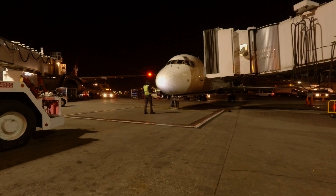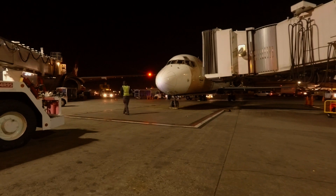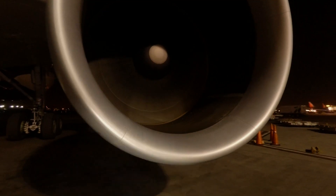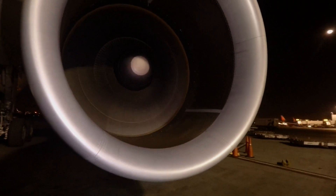And then when I have to look all the way up at the top of the vertical stabilizer, I'll turn it into the spot mode. Even with our logo lights on, it'll overpower the logo lights and allow me to see if there's any kind of bird strike, a dent in the leading edge, or any kind of delamination — anything at all really.